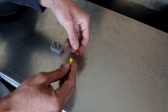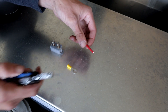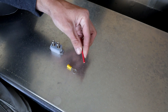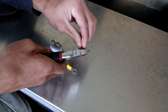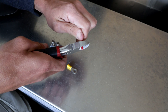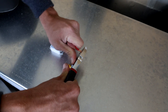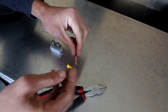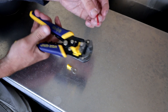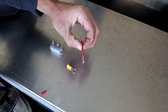We need to strip off the insulation to expose the cable so we can attach it to the lug. There are a couple of different ways to do this. You can just use a knife to trim the insulation around and pull it off, or you can use side cutters. You can get really good at it and manage not to cut any of the little cores inside. Now if you're not being cheap and you actually want to do it properly, you can buy yourself a proper cable stripper. All you do is put it in there and done.